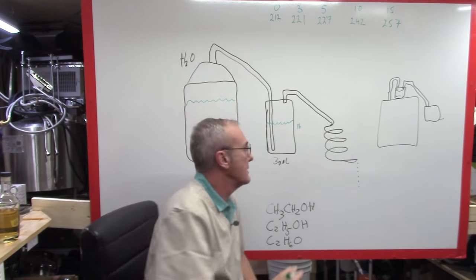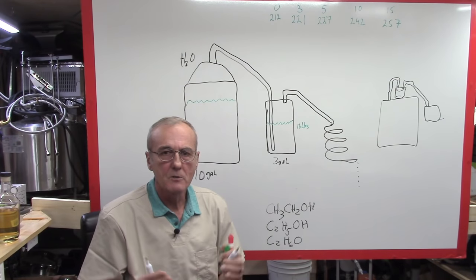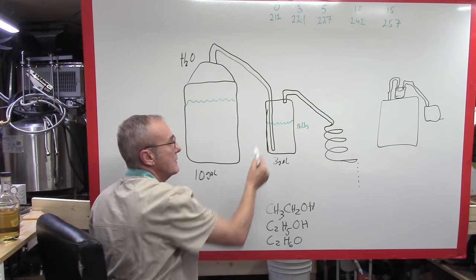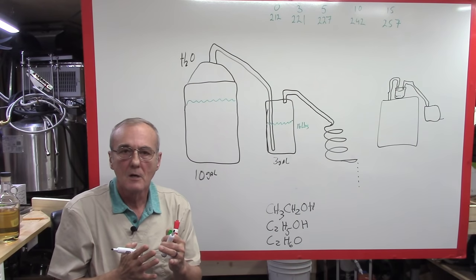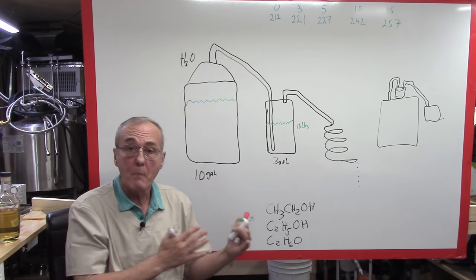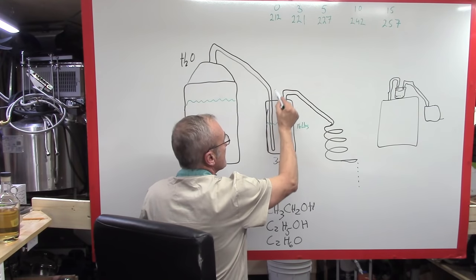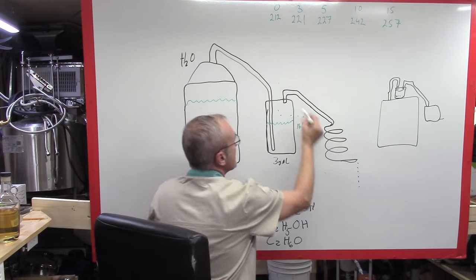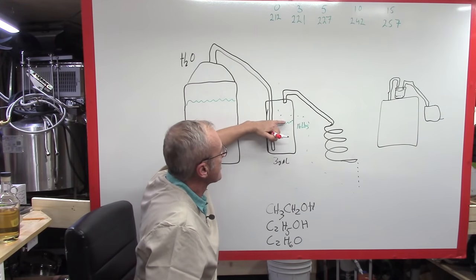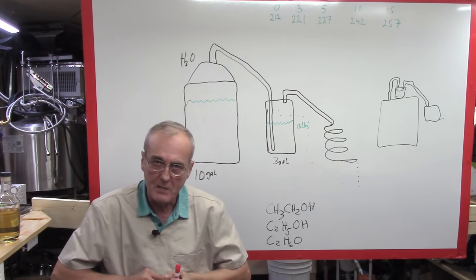Why is that important? 2 gallons of water weighs a little bit over 16, but let's say 16 pounds. So right now, what we have is known as a closed system, and that is because this pipe is beneath the level of this liquid, which closes that system off and allows you to have what's known as back pressure. And in fact, you need back pressure in order to operate a thumper. But from this point forward, it is an open system because it is open to the atmosphere. So we've got 14.7 pounds per square inch pushing down on top of this 16 pounds of water. No, you don't add those together. That's not what it needs to overcome.